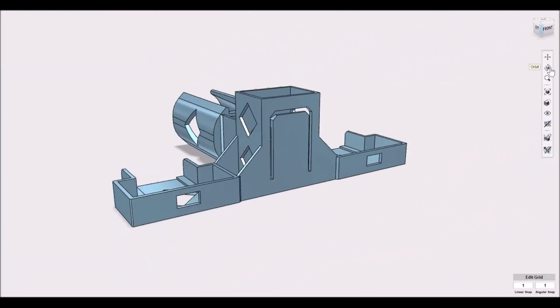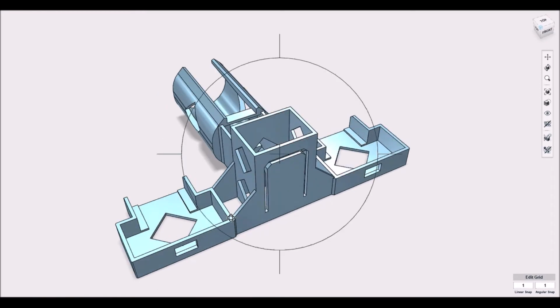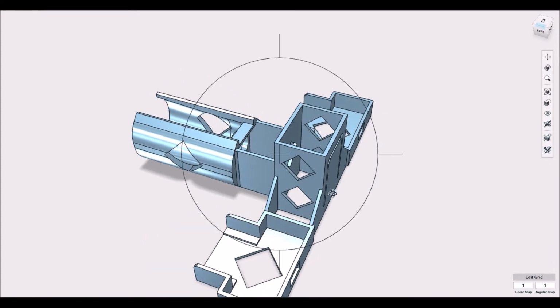This bracket positions one of those sensors on either side of the vertical shaft coming from the stand. The extension in the middle of the bracket houses a telephoto lens that goes in front of the RGB color sensor. There are various diamond-shaped cutouts in the bracket to reduce the amount of plastic used by the printer. This fairly complicated shape prints fine with no supports at all.